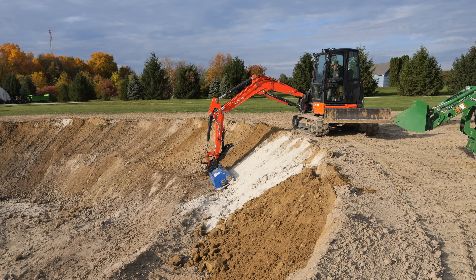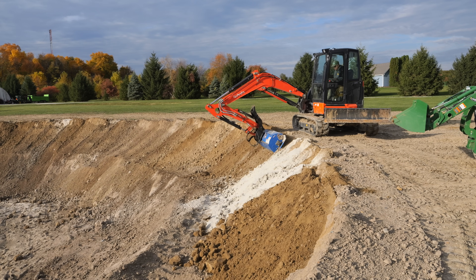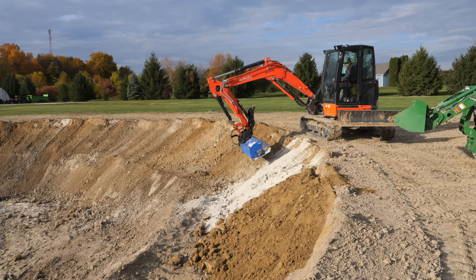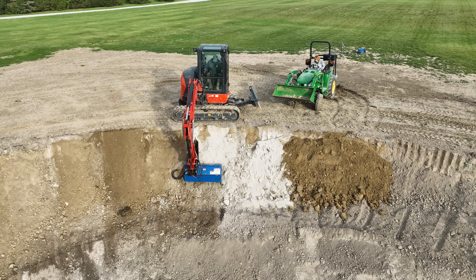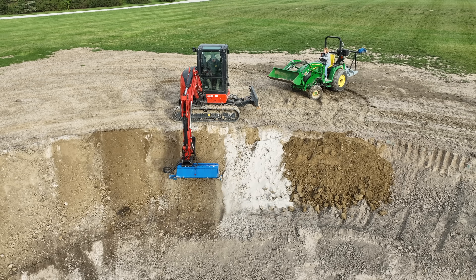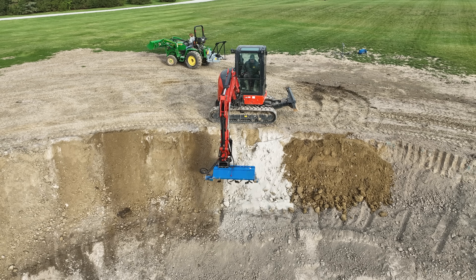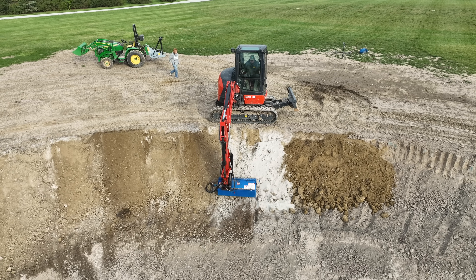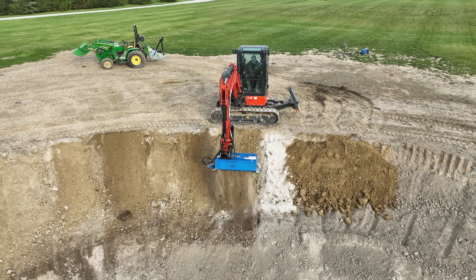Back to the cost: $14,000 for the bentonite, a little over $1,000 for the tiller, probably 200 gallons of fuel, and maybe $150 to $200 on the sump pump. I paid close to $2,500 for the irrigation pump I used to pump the pond originally — maybe more, especially after I got the hoses. I chose the 4-inch version, and that was significantly more costly than a 3-inch. I would recommend to anybody buying a trash pump: if you think you can get by with a 3-inch, use a 3-inch — it's just so much more readily available.